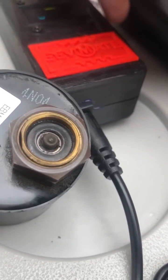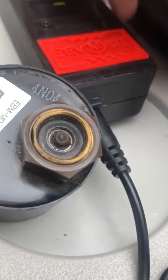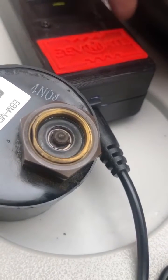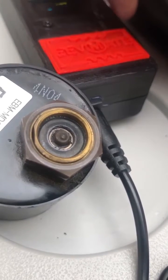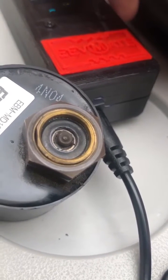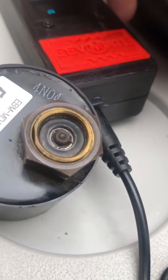Those gears are probably getting a little bit worn — might be some deterioration of this little assembly here. So it's probably a good idea to go ahead and replace this one. But this one will definitely get you by using this tool — kind of get you out of a bind. This is a great tool for troubleshooting EEVs to make sure that they're functional.